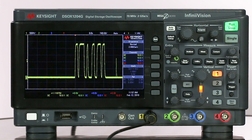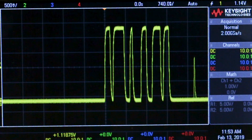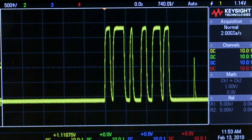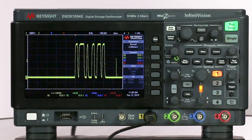Let's look at this packet of pulses as an example. This entire packet is about 250 microseconds wide, and I can see there's a little glitch on the end that I also want to capture, so the entire packet is about 350 microseconds wide. That packet width is far longer than the trigger rearm time. You can see as I'm triggering on the signal there's some flickering — the oscilloscope is triggering on that first pulse in the packet, rearming, and then incorrectly triggering again on another pulse in that same packet.